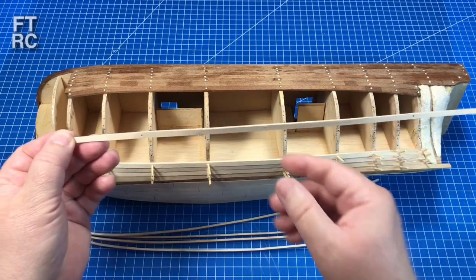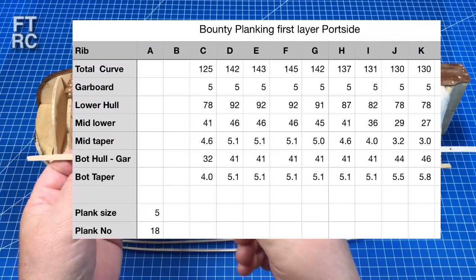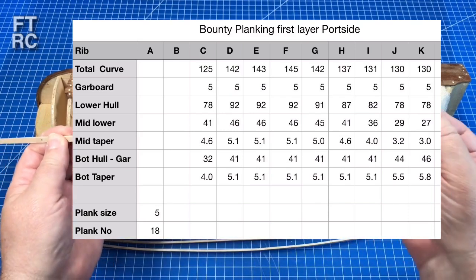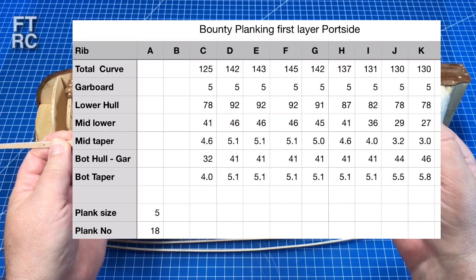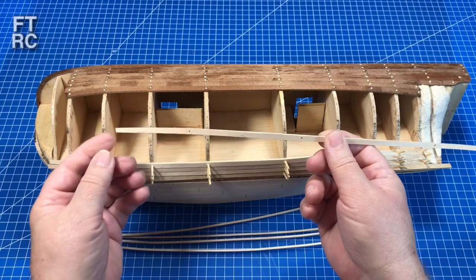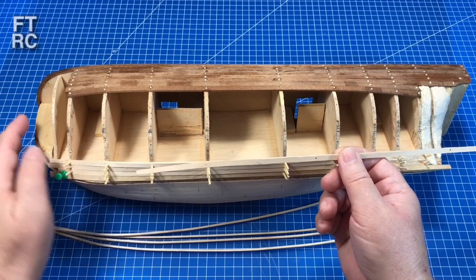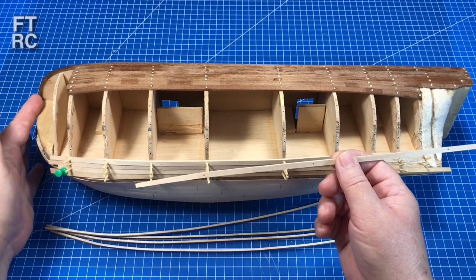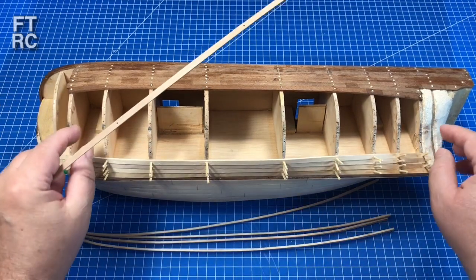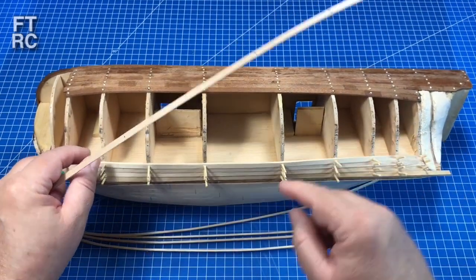There's a tapering chart with a lot of numbers, but basically the stern part didn't require any tapering at all — in fact it's going to need wedges, more about that later. The only tapering I needed was at the bow, which I've called the C rib. I lettered the ribs A, B, C and so on through to J and K, writing them on the rib so I'd remember.